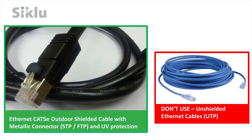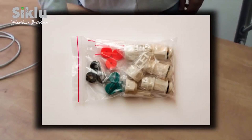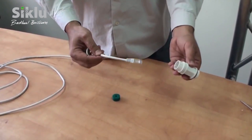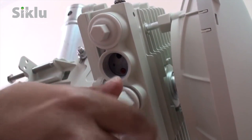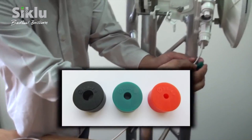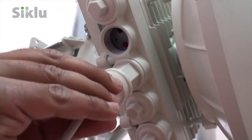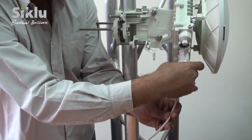Category 5E or 6 Ethernet cables must be shielded and terminated using metallic RJ45 connectors. Three sets of protective all-weather shells are provided in each ODU box, fitting cables from 3.5 to 9 mm in diameter. Connect the Ethernet cable to port RJ1 of the ODU. Select a rubber gasket that best fits the cable diameter — note that the rubber gasket is spliced and can be assembled on cables with connectors. Secure the all-weather shells by hand only; do not use tools.